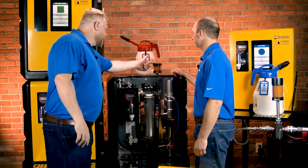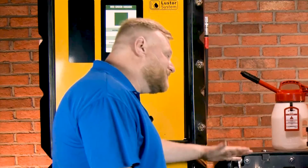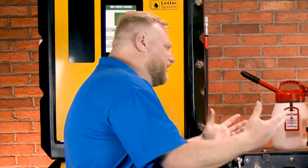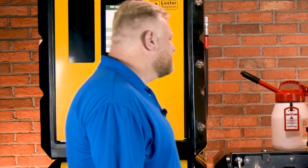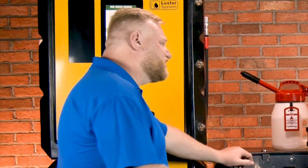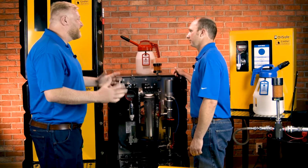And then specifically on the top, we've got these desiccant breathers, right, to be able to manage that headspace. So minimizing the amount of moisture as well as particle ingression that is going to be breathed in over time into this system. And I know with these guys specifically, with WHITMORE, this one looks sized appropriately for this system, but they offer a lot of great options, a lot of different sizes for desiccant breathers.